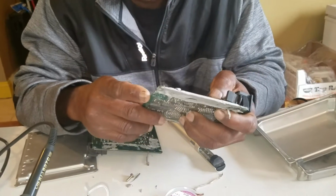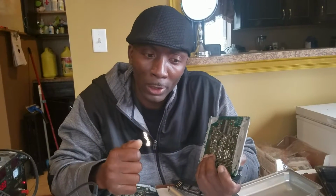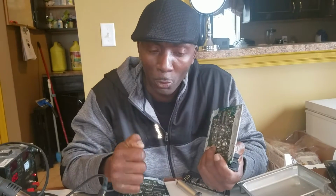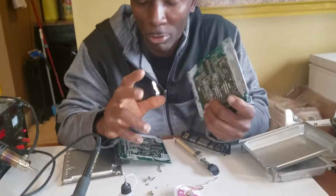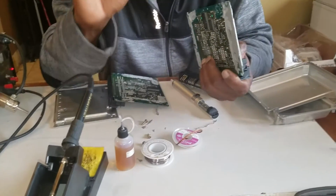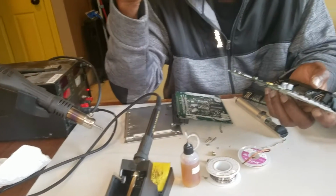I mean, I did it before, but the problem that I was having, the instrument cluster holds the information of your VIN. So what was happening, every time I try to log NCS Expert or any program to the car, I get a VIN mismatch error popping up. Even though the car starts, runs and everything, I keep getting a VIN mismatch fault code popping up.